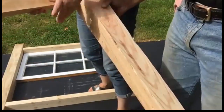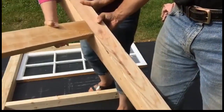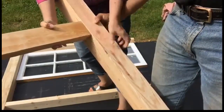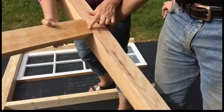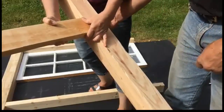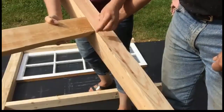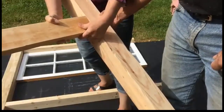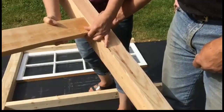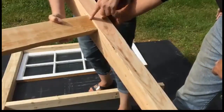Okay. Can you guys see that? Sort of. Okay, down a bit. I'll go up to here. Okay, if that butts up right to there, when you paint that, that's going to look ugly, like totally ugly. It's not going to be a nice joint. It's not going to paint nice because this edge is rounded over. That one's sharp. What you want to do is trim this one back a bit. So even an eighth will help, or bring it down to a quarter. That gives you a nice joint in there.